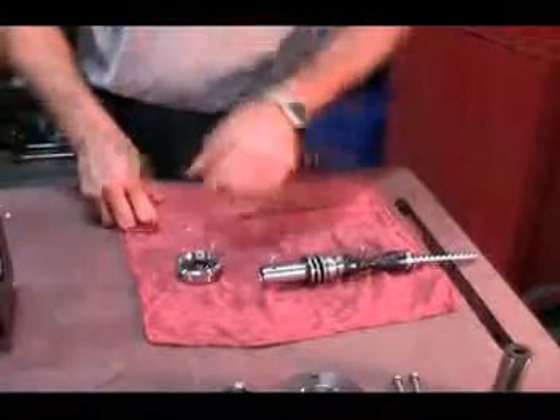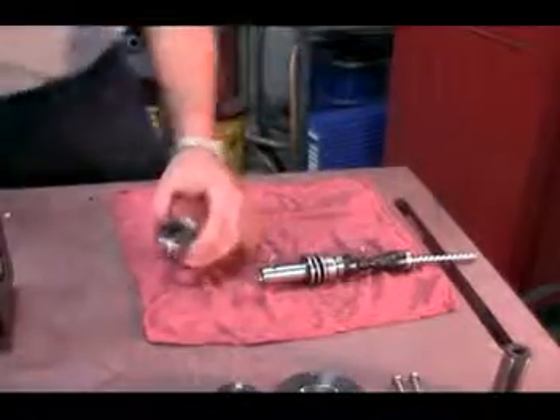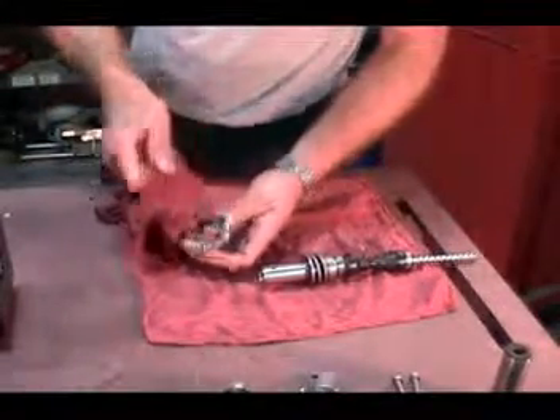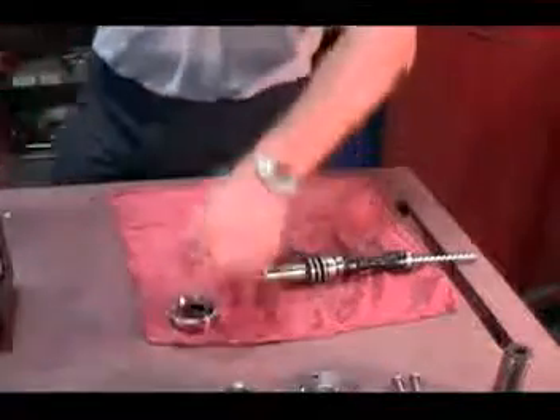Make sure that your fingers are relatively clean and free from any metal particles. Clean the faces off so that you won't have anything that can scratch the faces. Install the seal housing in the lantern of the pump.